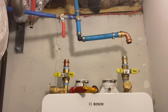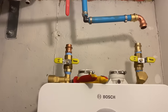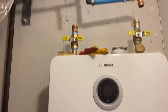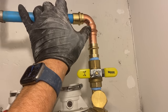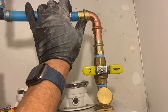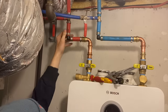We have the unit mounted on the wall. Right now we're working on the near piping directly above the water heater. This is like putting lipstick on a pig — you have all this nice copper and brass above the machine, but we're using PEX. I'm not saying anything bad about PEX, it's just cost-effective but not as pretty as copper. Daniel just made a short nipple piece and we're going to press in this male adapter, this street 90, into this PEX crimp adapter, then work on the venting and the gas using Viega MegaPress.